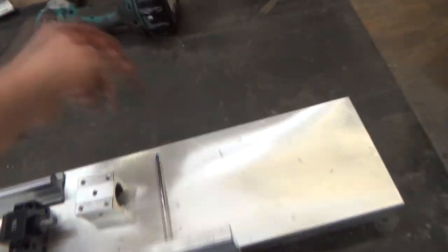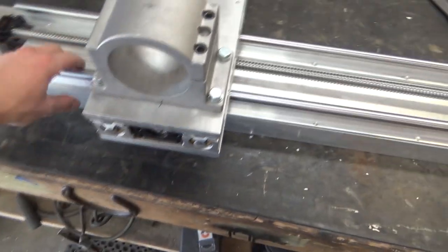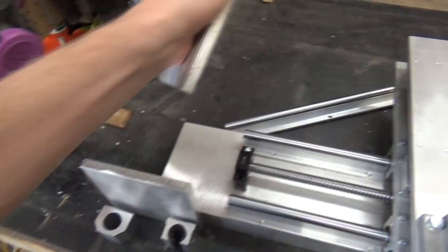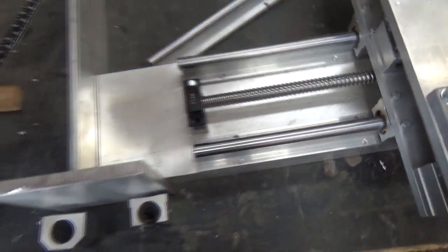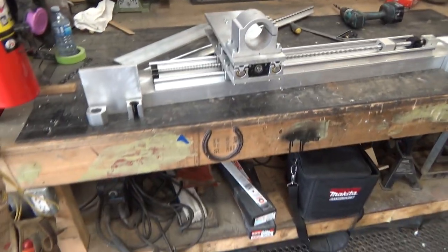Once this is cut and these are drilled on and that's done, I'm going to bolt these on and then weld it to maintain a little more rigidity, so it doesn't bow out too badly when it welds. Hopefully it won't. Then there'll be chunks of this 3/8 plate, I guess it's not really plate, it's extrusion, flat bar. Weld it on kind of like that to give it a little more twisting rigidity. And then that'll be the gantry setup.